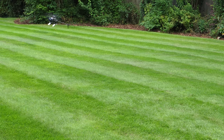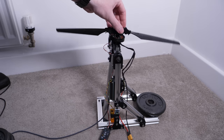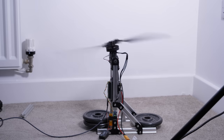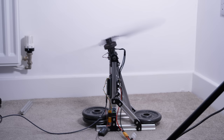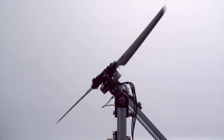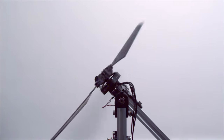Now when I built the previous helicopter, I crashed it quite a few times before I could get it to work. But with this project, I'd prefer it didn't crash at all. So I've built a test rig that allows the motor and rotor head to pivot in one axis, and so far it seems to be working well. Especially in slow motion, it's very clear that the blades create a greater angle of attack on one side than the other, but there's something missing from this setup.